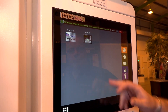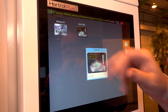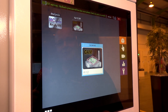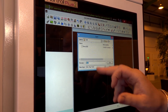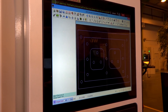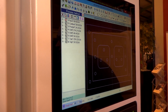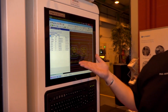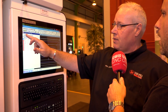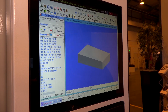Can you show us a screen where you've got a part drawn up? Okay, so it's all touch screen. There you go — I already have a part built in. As you can see, it's a standard DXF file and we've programmed it literally on the machine by touch screen. Once we've programmed it, we can simulate it on the machine, either a single part or the whole thing. It's already generated the code, so we can save that code and transfer it directly to the control — all we've got to do is set tools and we're away.